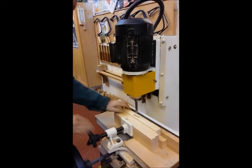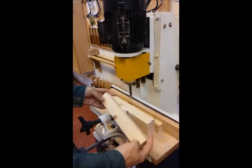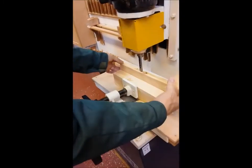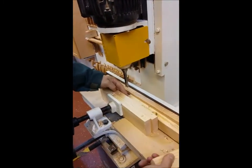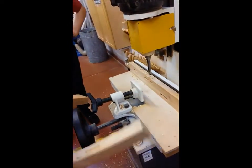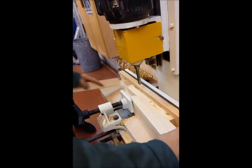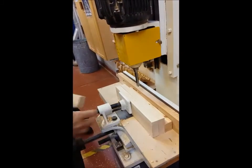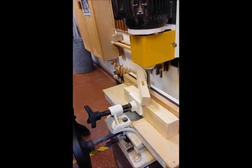On the right here we have a stay which is permanently fixed to the wall to keep the lever back up in place so it doesn't accidentally fall down. There we have our marks taken out, and a sacrificial piece underneath so the chisel doesn't burst through the workpiece — you need to move that around each time. Also make sure the bench is completely free from sawdust so it doesn't obstruct the piece when it's set back in. That's pretty much the mortiser — a really quick and useful tool for cutting out mortises.